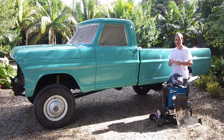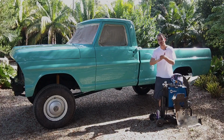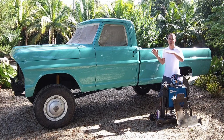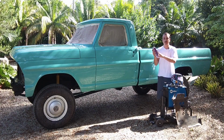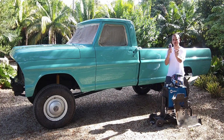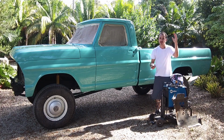Once I cut those pieces of steel out, you could see there, I cleaned them up with the die grinder. And this is a very important step that a lot of people don't do. When you're joining those pieces of steel, there's always a chance that some of it isn't welded through, especially on auto body work. When you're laying steel on top of steel, there's always an area that stays exposed. So what you need to use is some Weld-Thru Primer. You shoot this on the pieces of steel that are going to join up, and if the weld doesn't cover the entire exposed piece of steel, it stays primed and doesn't have the chance of rusting or corrosion coming through.